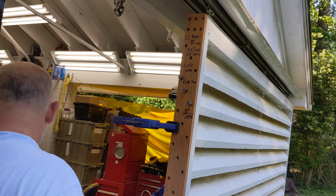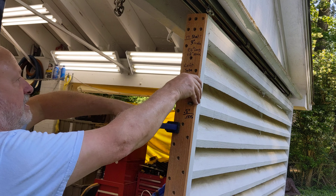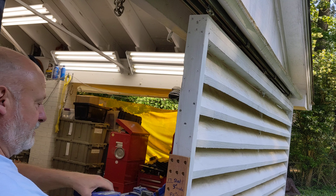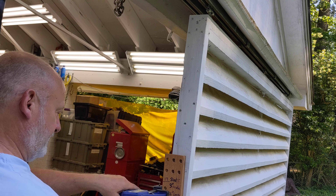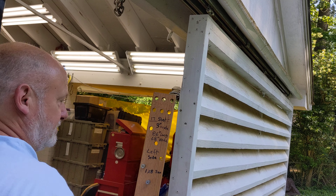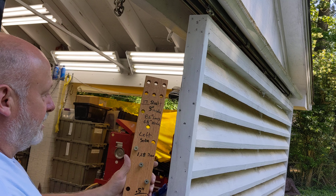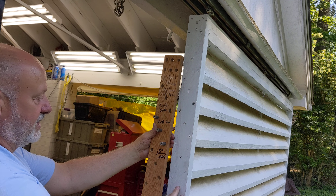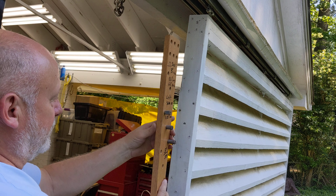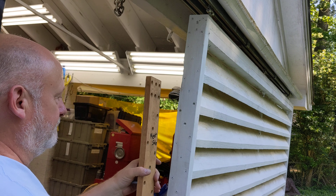On the very last one I'd leave an extra drill bit in there, then move the jig down to that spot and continue the drill pattern all the way down. If you notice, this says 'left side' and on the back 'right side.' On this side this would be considered the left side. On the other side of the door I turn it around so the right side is shown and drill the same pattern on the right side.